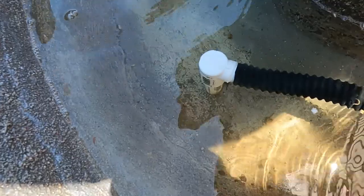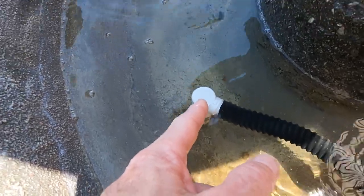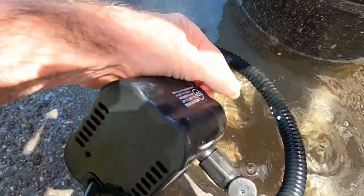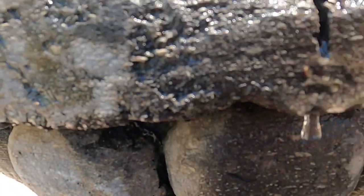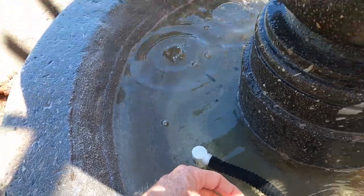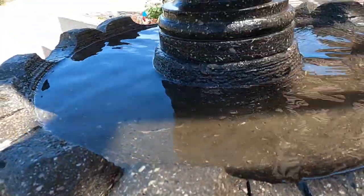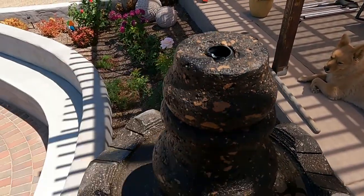Down here, the pipe that you saw sticking out of the concrete, I put a slip on the bottom portion of that slid down. Once you put some PVC glue and you slide that piece down onto the pipe, this has male threads on this end to screw this hosing on that I have. This hosing is also the same hose that I put right in here somewhere, where the PVC pipe ended. I put an end piece, like a cap similar to that, except it was straight. It was a slip-on. It glued onto the end of the pipe, and then it had male threads going straight up. So then I screwed on this type of tubing right here, and it comes all the way up the rest of the way, and you can see it peeking out the top there. And then I just cut it off with an X-Acto.